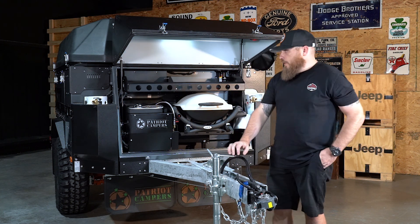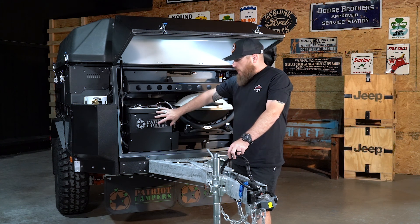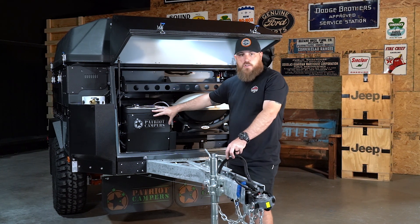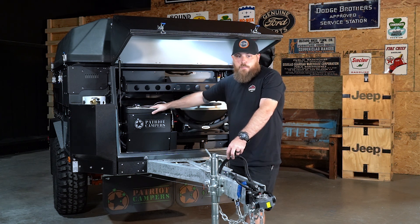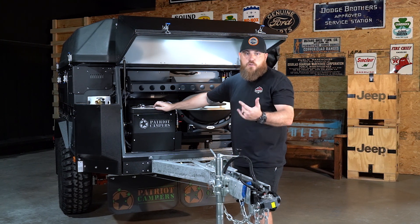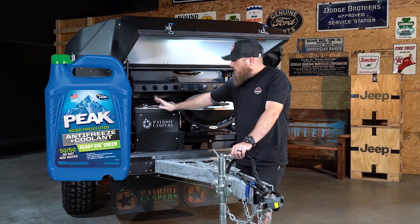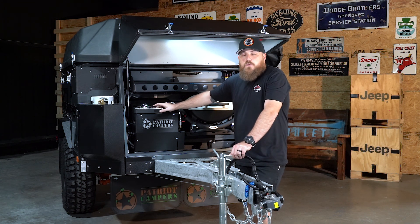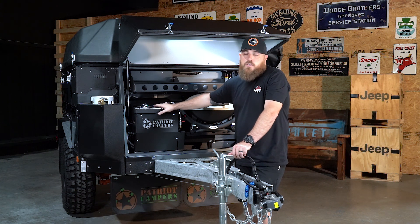In the lower unit you have the actual diesel burner and the glycol tank. All of your water heating is done in this lower unit, with plumbing for the shower, kitchen sink, and so on. The antifreeze inside is a 50/50 mix — 50% deionized water and 50% glycol, your standard off-the-shelf green 50/50 antifreeze. Webasto's recommendation is the Peak brand. If you're low on coolant, refill with that — don't use pure water or a different color of antifreeze.